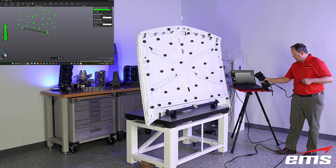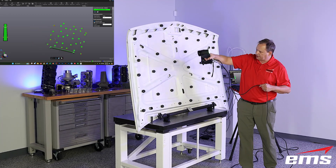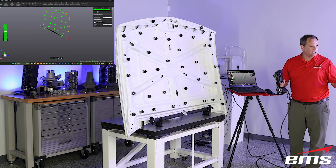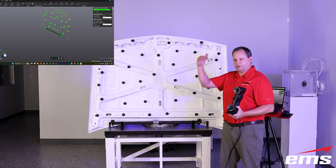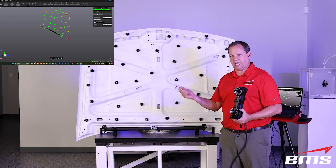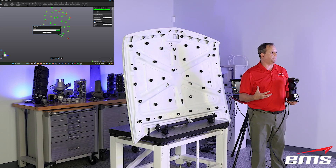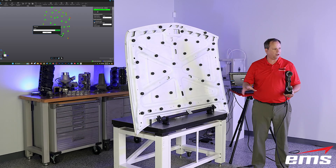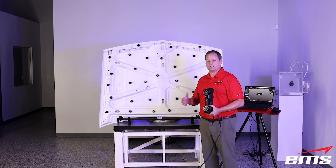It's very fast. We'll move around — we're never going to get all of them. A lot of the targets on these 360s that are down low on the sides you're just not going to get enough readings on. But the ones that are more perpendicular to us are really the ones we're after. You don't have to use the 360 targets; you can use normal targets. Once we're done, we stop. This gives us a list of all of those targets, and if we want, we can actually delete some if we can't get good readings on them to try to get the best accuracy possible. Then it's going to optimize that volume — looking at all of them and trying to tighten up this target volume as accurately as possible. That's how we can achieve very good accuracy over distance with these new systems.